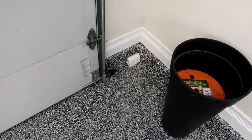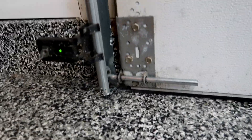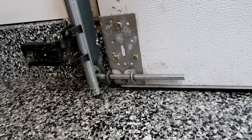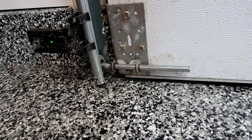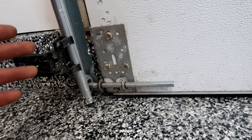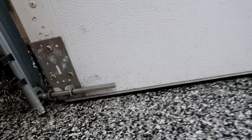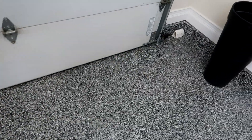We always recommend keeping everything two to three feet back from the corners. Also watch out for spiders — they love these sensors and make their webs right in front of them. Grass, leaves, cotton in the spring and fall can get tangled up in there and cause problems. It's not necessarily a sensor issue, the sensors are just being blocked. Also check along the bottom of the door all the way across — cobwebs, grass, leaves, and cotton can accumulate there too.